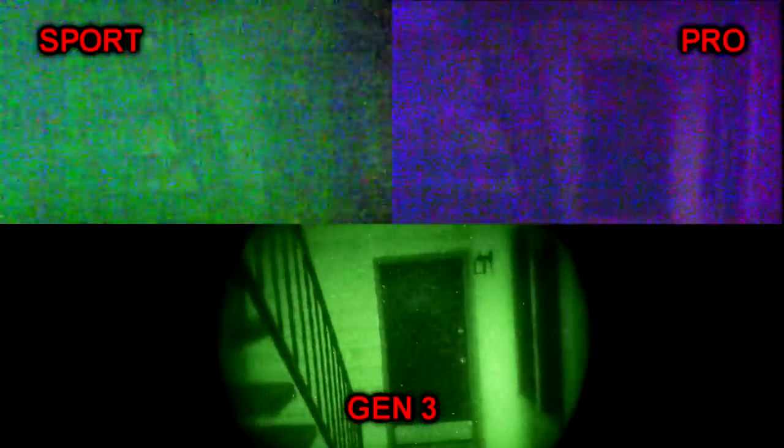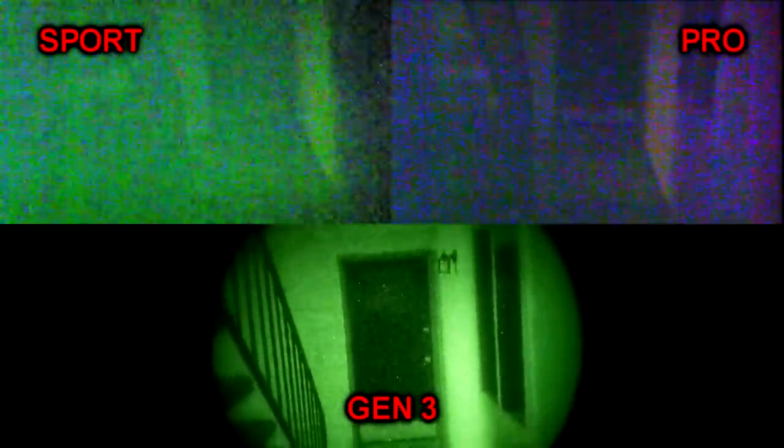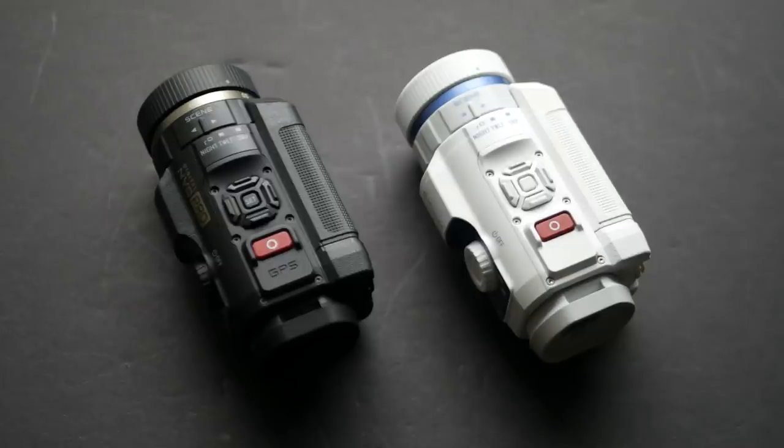Despite the increase in performance on the Pro, it still doesn't even come close to the low-light performance of Generation 2 night vision. All of the other limitations — the incredibly narrow field of view, the frame rate, the latency, and the low resolution — are all still issues with the Pro. Something important to understand about digital versus analog night vision is the performance fall-off. With the Aurora Sport and Pro, everything looks pretty much fine until you hit a light level at which point the image goes from decent to terrible immediately. With Generation 2 or 3 night vision in extremely low light, you may not get a daylight-bright image, but you get something usable — whereas with digital night vision, as soon as you hit that limit, it turns into complete digital noise.